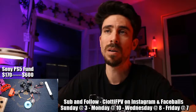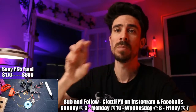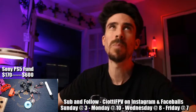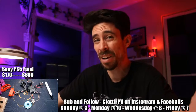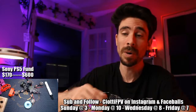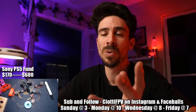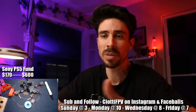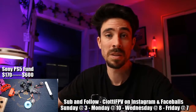No. Well, I mean, if you take Smart Audio off TX2, it will. But you can't double up. Smart Audio is going to be sending info that the logger is not going to want. Yeah, it's just not going to work at all. So if you pull Smart Audio, which is not the end of the world, right? How often do you really change your channel? And your VTX probably still has a button on it. So God forbid you don't have Smart Audio, you still have the button. You're going to have to look it up. It's going to be a nightmare. But not the end of the world, right? And you're probably not going to use the logger forever, right? The loggers are usually like you install them, you get the tune dialed in, then you pull them off. So yeah, take Smart Audio off TX2 and put the logger on there for the time being, and then switch them back.